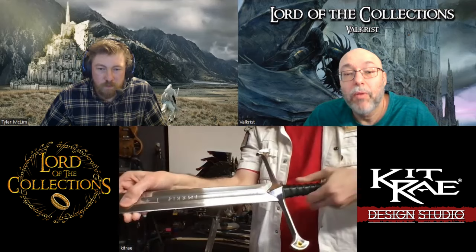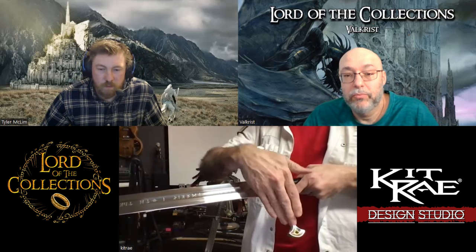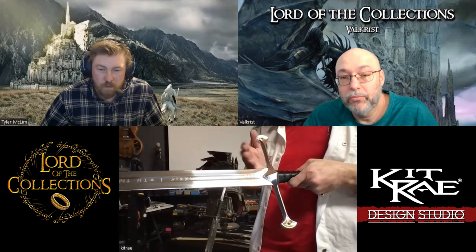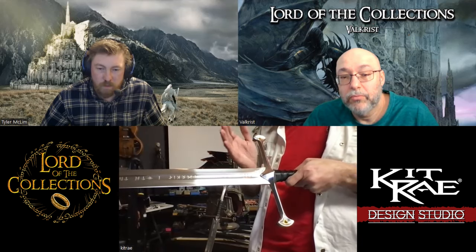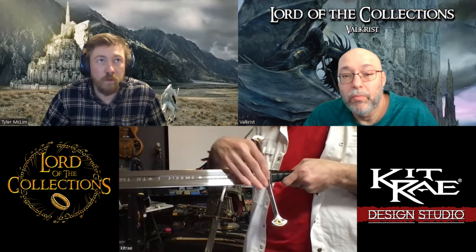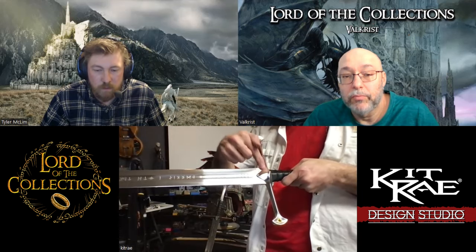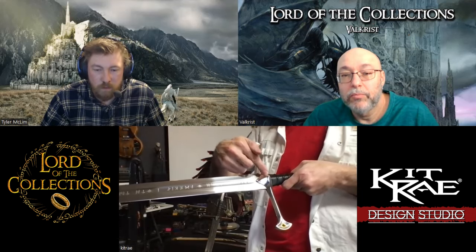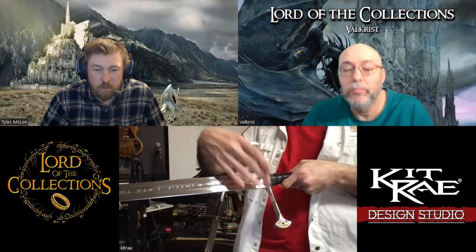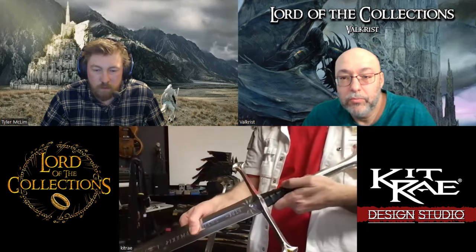And what we are doing in production, you guys know that these aren't the hilt parts, the guards and pommels on almost everything. They're not steel, they're cast zinc, which is the only way we could do these in production. But they always had a plating on them. If it was supposed to be steel, it's what we call antique nickel plating. You do a little polishing on it, put a clear coat on it, and that's how most of the Lord of the Rings sword hilts are made.